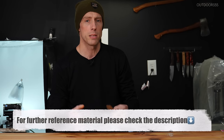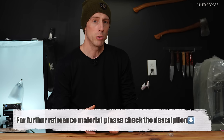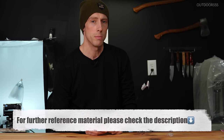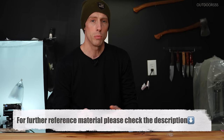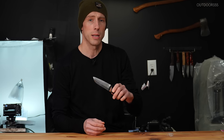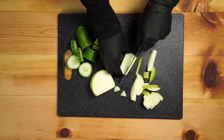So just like with anything else, there is a balance. But realize that primary geometry thickness and geometry in general is actually the most important thing when it comes to what makes a knife sharp. It also plays a huge role — if not maybe the most important role — in edge retention. I'll leave you with this: how long do you think a knife like this, with zero apex, retains its edge under normal kitchen use? Is there such a thing as edge retention for a completely squared-off apex? Like I said, just scratching the surface.